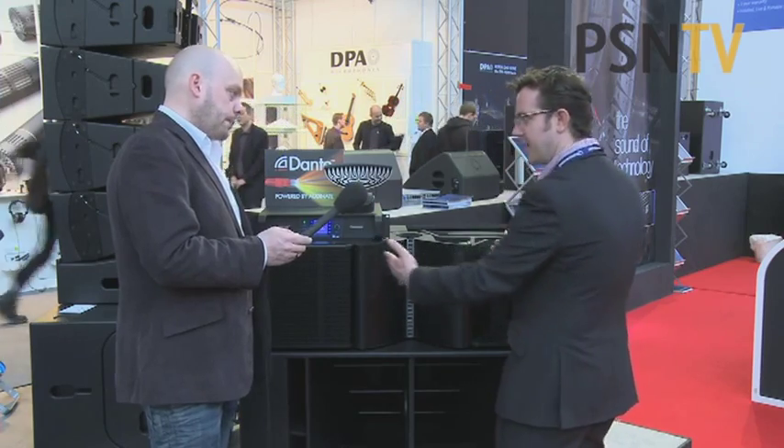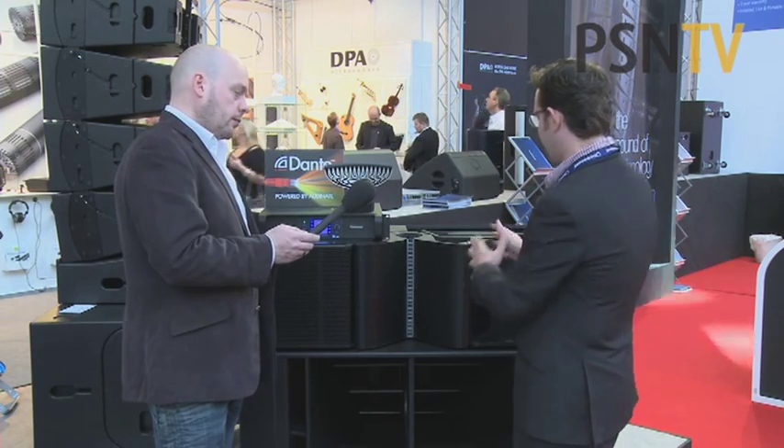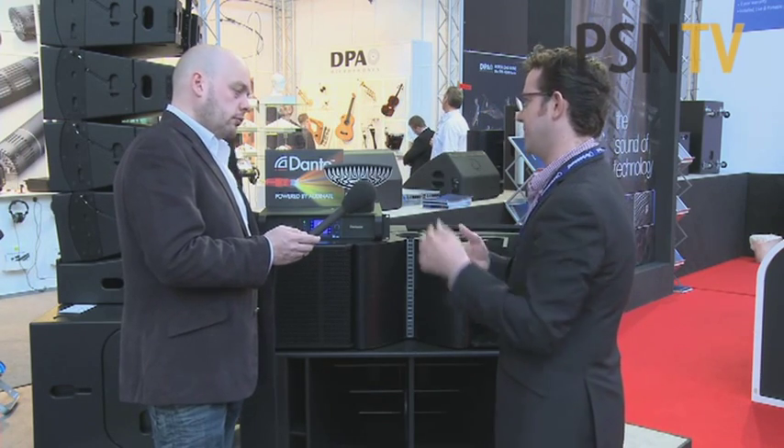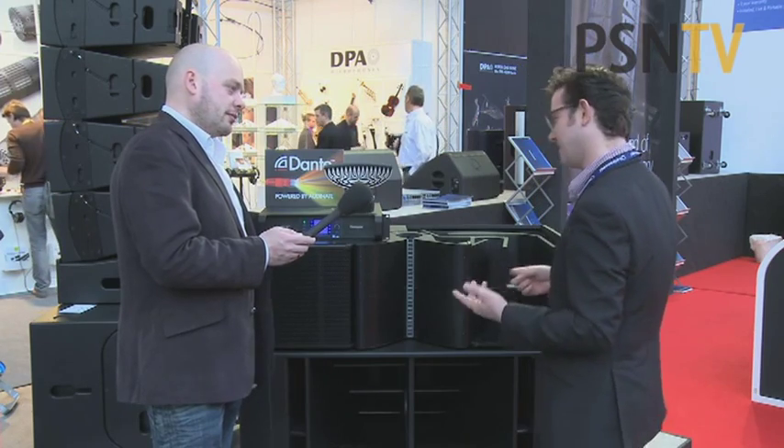From there they cover 60 to 250 Hz-ish. The reason they can't go any higher than 250 Hz is it starts to get narrow and break. So we then go into another band that's slightly closer together, covering 250 to 600 Hz. That's a unique loading in the line array market — most people have direct radiating drivers, and whilst there's nothing wrong with that, it's not what people know us for, and it isn't TurboSound.